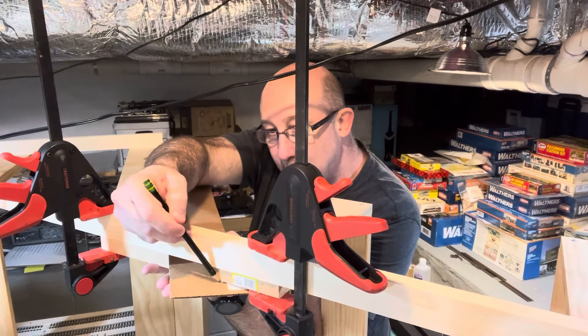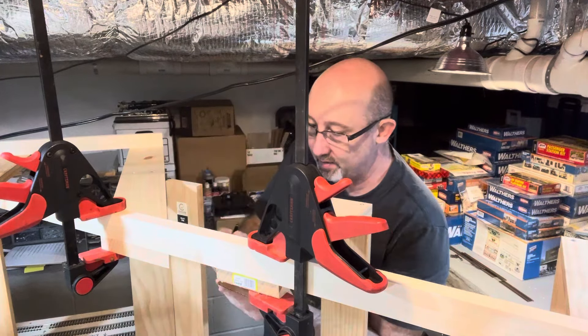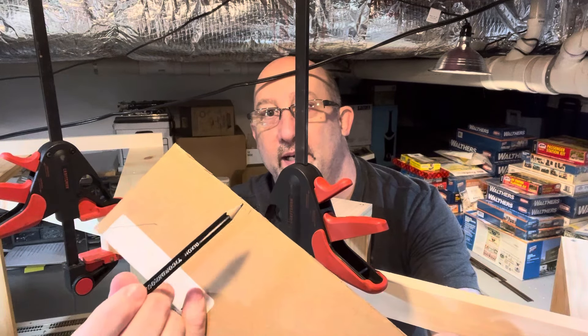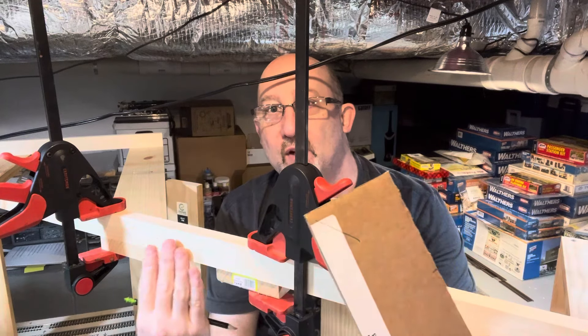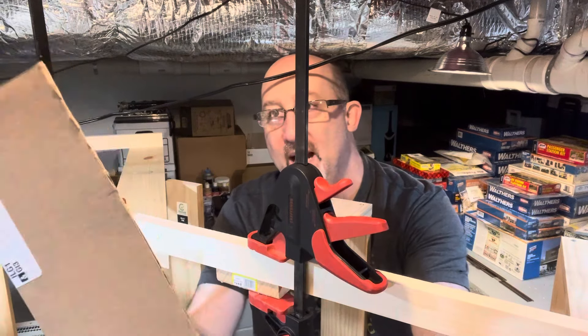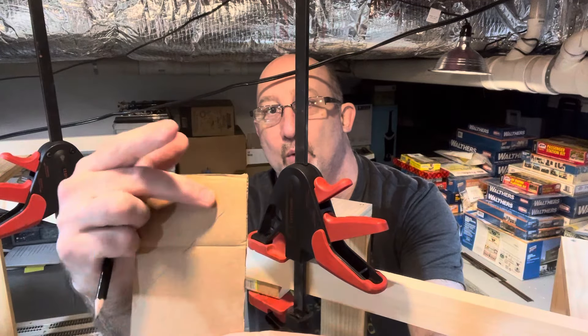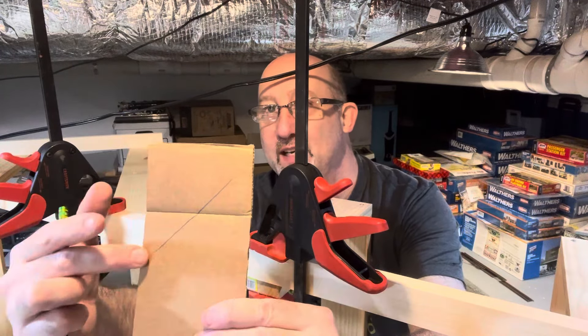Since this is a front face, I'm going to draw a line there. I don't know if you can see that in the light, but what I have is a line here and a mark here. I can connect those, and that gives me the angle for this front section — and on the back side underneath, that's 45 degrees, or whatever close to 45 it is, for the back piece back here.